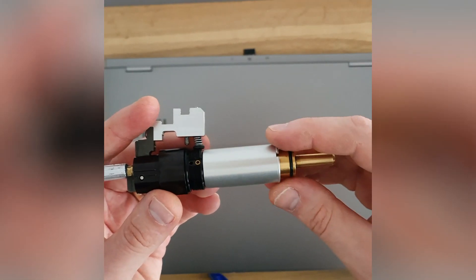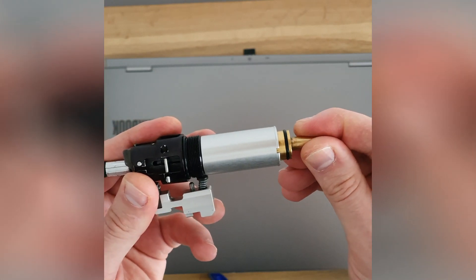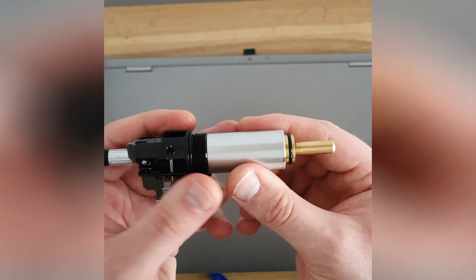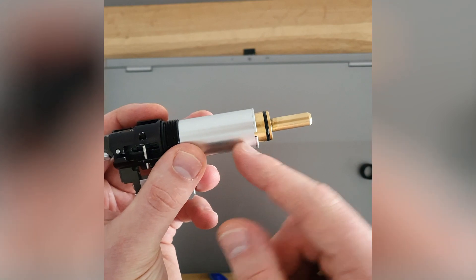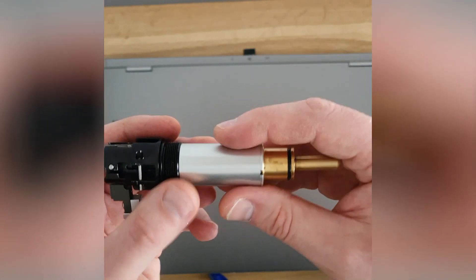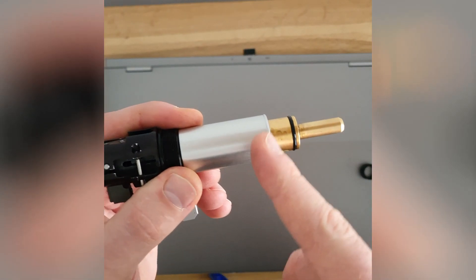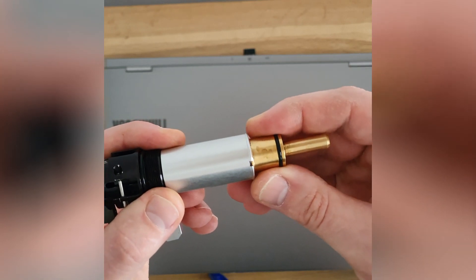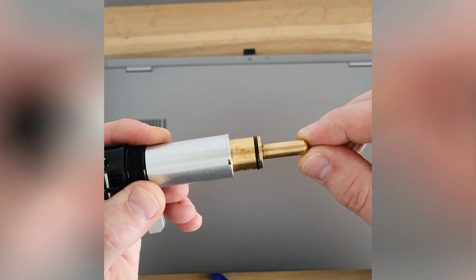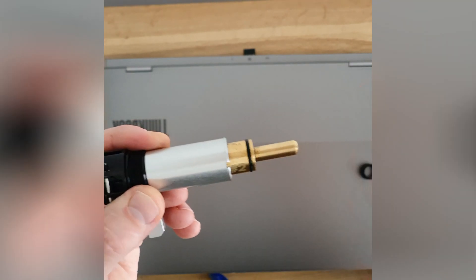Now that we've gone through the details, the cycle goes as follows: we have reset the engine, the air pushes on the nozzle, the nozzle retracts and resets the spool to the backwards position. Since the spool is in a backwards position, the air can flow into the engine. As the air fills the dump chamber, the pressure from the dump chamber is greater than the force pushing the nozzle back, so the nozzle returns forward. Once we push the trigger, the spool shoots to the front, exposes the holes in the spool, and the air escapes from the dump chamber via the nozzle out of the engine. As the pressure drops in the dump chamber, the nozzle is pushed back once again — once the pressure pushing the nozzle back is greater than the pressure from the dump chamber pushing forward.